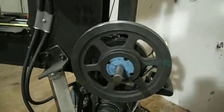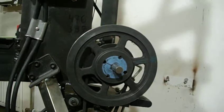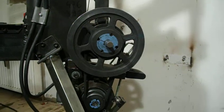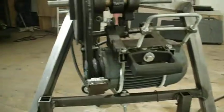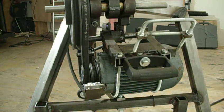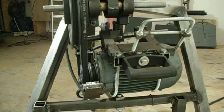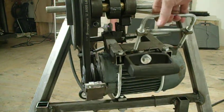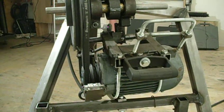The pulleys are taper lock pulleys. No machining on the shaft is needed for the keyway. The bushing just locks in there with 2 set screws. It's very nice. I got 4 different speeds: 400, 500, 800 and 900. The motor is a heavy-duty industrial motor, 380 volts, 2.5 horsepower, 1800 watts and 1400 RPM. I can tilt the motor up and then loosen the belt tension, and therefore I can soft start the machine.